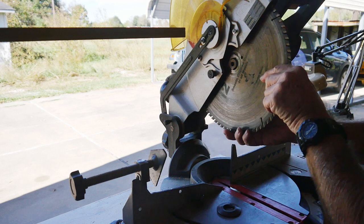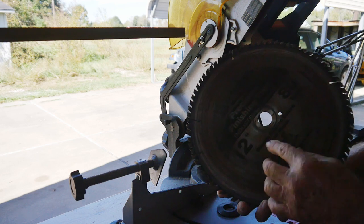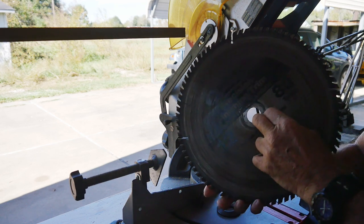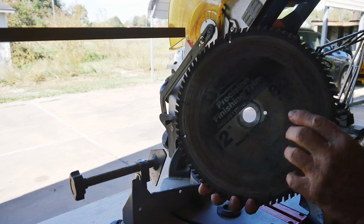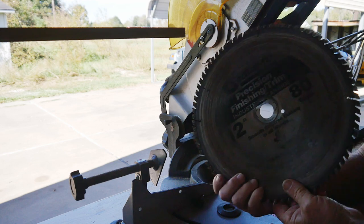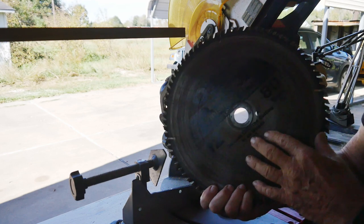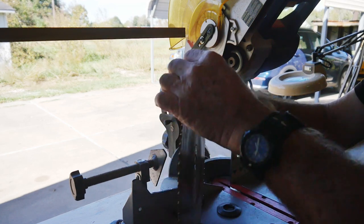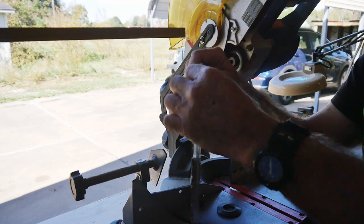Take your pieces off. That's going to expose a blade with an arbor. We're talking about arbor sizes — this is a 7/8 arbor size, as opposed to a 5/8 on a 10-inch or a circular saw, or the new 30-millimeter that I ran into a few weeks ago. Anyway, this is the blade — this particular blade we're going to sharpen.